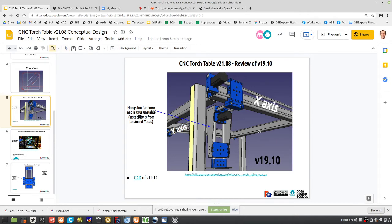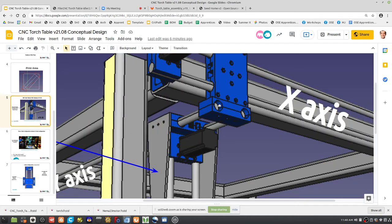Like here, as an example, if it didn't work for us to have those nut catchers that are invisible inside the carriage piece here, we could put a flat plate here and use this face and the end face here. So that would work too. Or even a piece that attaches just to this and then goes around the bottom like a shelf, with some other bolts, like an angle that uses this face here and the bottom face of this piece, because we know we can always get many holes into the large flat face because there's a lot of space around there, right? So we have to just do interconnector pieces or build in attachment points right to this.